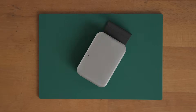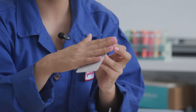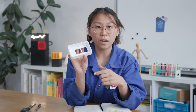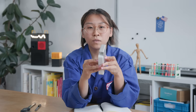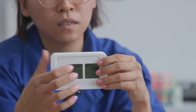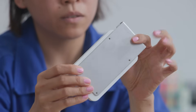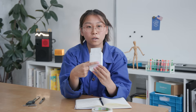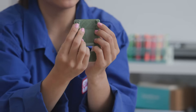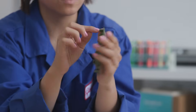Now that we have all the components from Digi-Key, it's time to start final assembly. The first thing is counter-sinking, which allows us to make the screw heads flat with the surface. There's going to be a housing and a mounting plate. The PCB sits in the housing — PCB inside, mounting plate squishes it all together. It sandwiches the sensor really close to the face so it's right up against the sheet metal part. You'll see four holes for thread-forming screws that engage with bosses on the mounting plate — the housing, sheet metal, and mounting plate all squish together with these thread-forming screws.